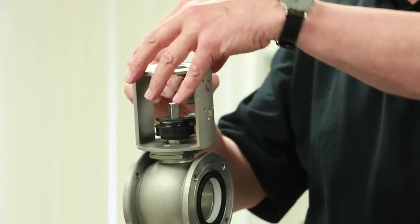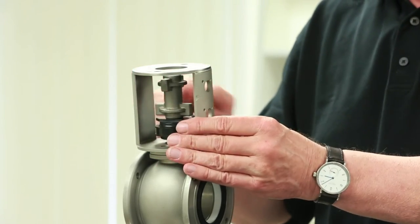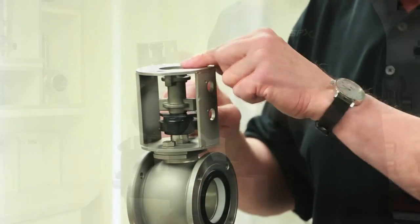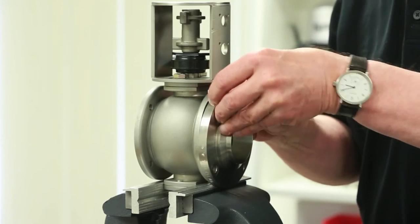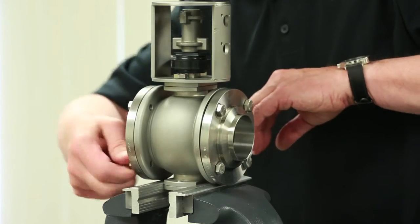Position the indicator and coupling prior to installing the retaining bolts. Bolts should only be tightened by hand at this time. Install the bolts with a spare set of connection cover flanges to help with seal retention during installation of the actuator.